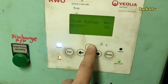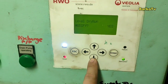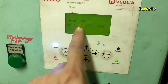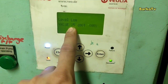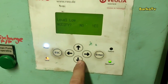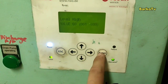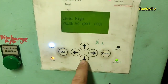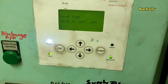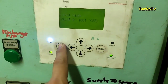We go to the level high and low settings — that is the setting for our pumps. Level low is where the discharge pump stops; the value is 25, which you can modify. Level high is where the discharge pump starts; you can also change that value.